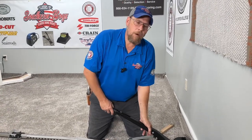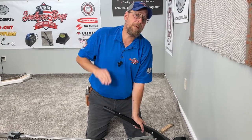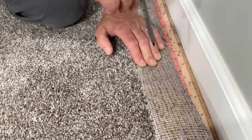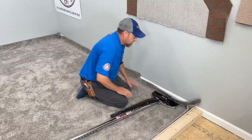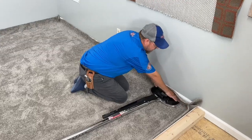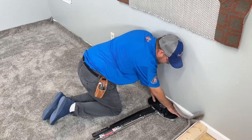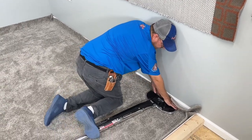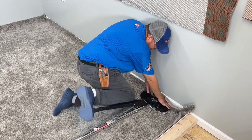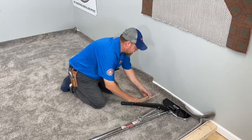Is this your first time installing carpet, or have you done it multiple times? Leave a comment and let me know where you're at on your carpet journey. Since I have the stretch, I have to get it secured on these tacks that are completely around the perimeter of the room. I'm going to take my hands and push the carpet down so I can feel those tacks pushing through the carpet. Since I have pressure on the tack strip, I'm going to reach over with my foot and just ever so slightly raise up on that handle while I have pressure down on the tacks.